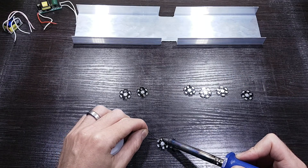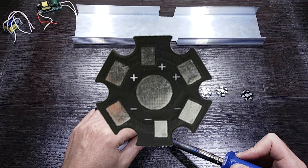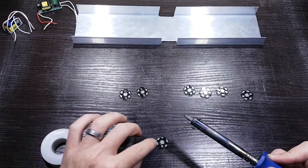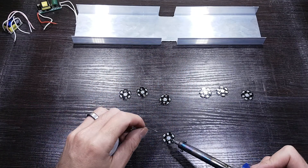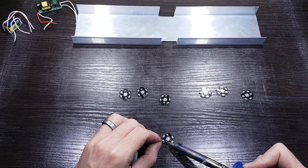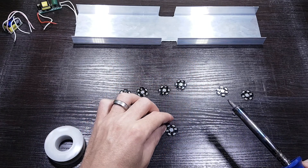The next step is to add soldering wire to the positive and negative sides of the LED base plates. Just make sure that you add it to the vertical blocks and not the horizontal blocks of the base plate. This can be very difficult if the base plate has some sort of oil on it, so wipe it down with toilet paper before you use it. I was too lazy to get up and fetch them, so I struggled for a good five minutes and ended up applying the first two a bit sketchy — so I redid them. You'll eventually get the hang of it though.